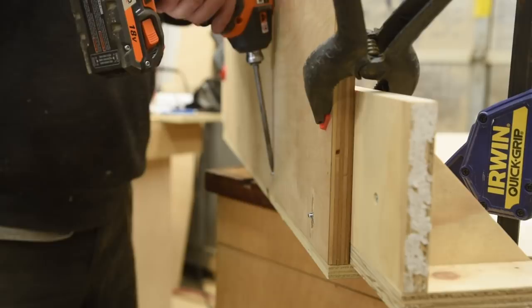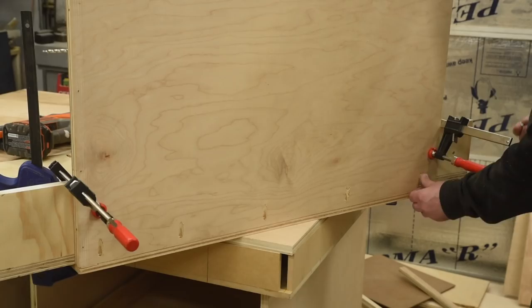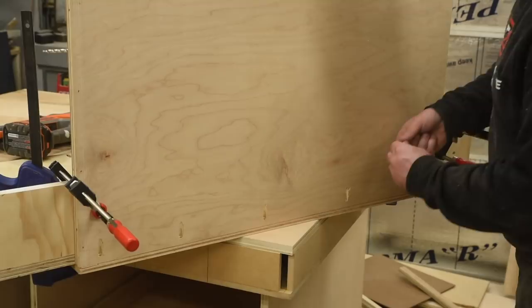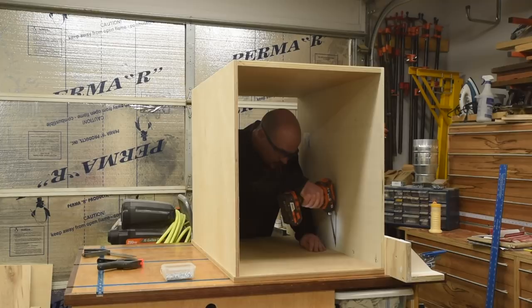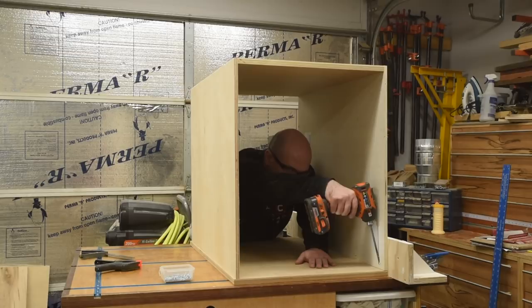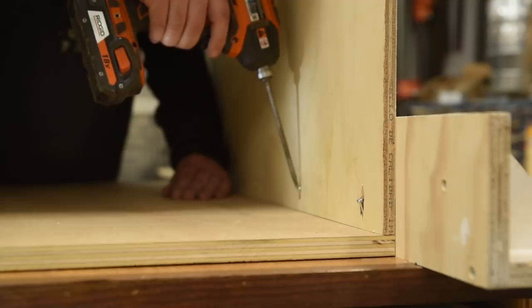I didn't completely think the next step through though, and was way over committed to using this guide. Looking back there's at least three better ways to arrange the material, but I picked the one that puts the most strain on the pocket screws and the clamps. Fortunately nothing broke while I got this together. Last was attaching the top — I clamped my jig to my assembly table and go to town. Having the fence on the assembly table gives me something to push against so I can keep the edge of the top flush with the side panel while I screw it together. I always want to see a continuous piece on the top so the top sits on top of any side pieces, and I like a continuous piece down the side so I set the bottom piece between the sides.